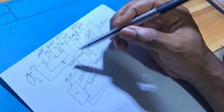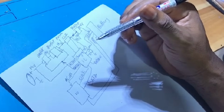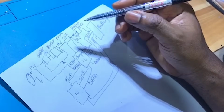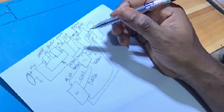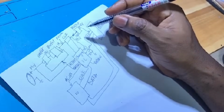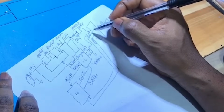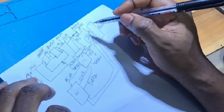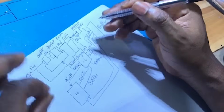Even though sometimes we check all these voltages with a multimeter and we get the correct readings, in some cases those readings are not really okay, because if you check with a DSO, we will find some frequency, and we don't need frequency there. Also, all this data communication, we cannot check with a multimeter. We need a DSO to check if the thing is actually communicating. So now I will check this motherboard and see where we have a problem.